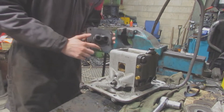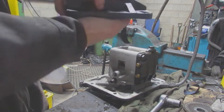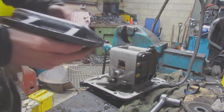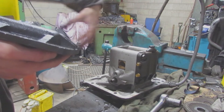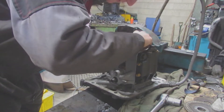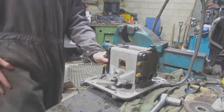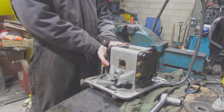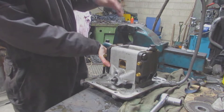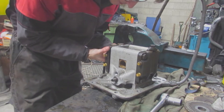I'll get this one on now. Obviously you can't get it wrong because of the dowel, and then the gasket. This one should say 'left hand' - if you're looking on the tractor, the PTO is over here and the rest of your tractor is over there. I'm just lining up the little - I call them pistons, I think they are pistons - with the sealing there. You also have to get the dowel lined up. These two pistons run on like a rod, it's like a rail, because they're oscillating. You have to make sure you keep them on that rod - it's sort of like a track. If you don't get them on there your pump won't spin.